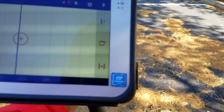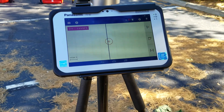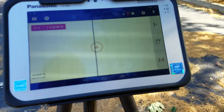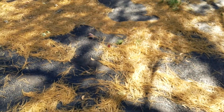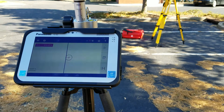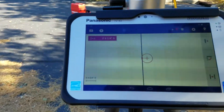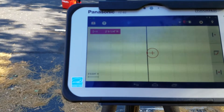It's telling me basically where I am in relation to that line. This offset shows: if I go forward, my 0.0 was there, which means my positive north is this way, which means the way I'm facing now is my positive east, and behind me is my negative east. So you can see I've moved positive east 2 feet 9 and 1/4 inch off my line.